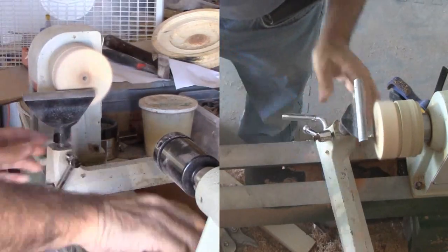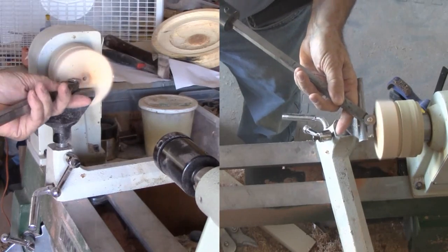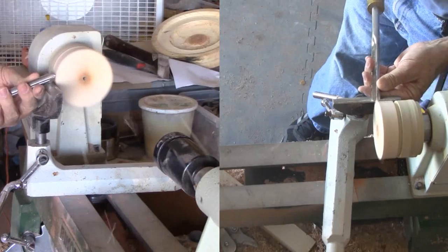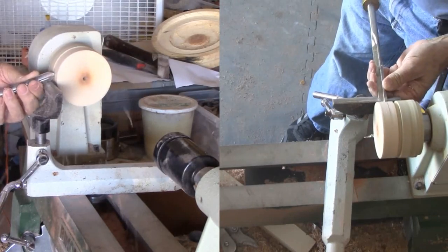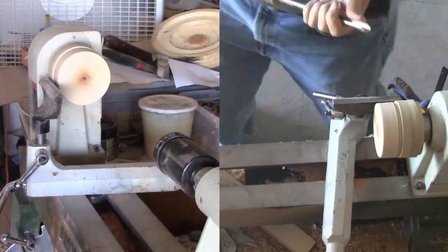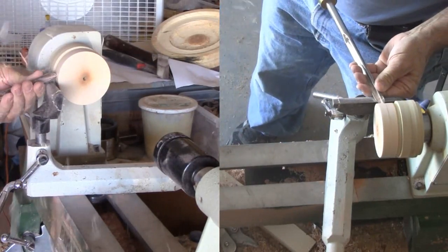Since the case is so deep, I decided to do the hollowing as I built up each segment ring. I glued two rings onto individual wood faceplates with normal glue. I'll build the rings from both the top and the bottom towards the middle, layer by layer.